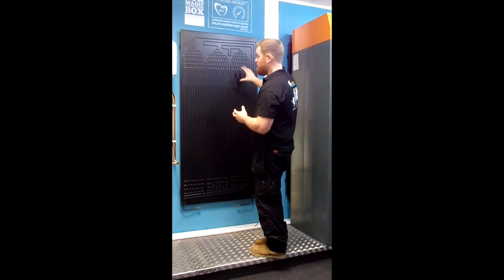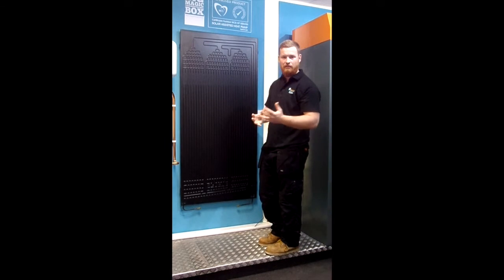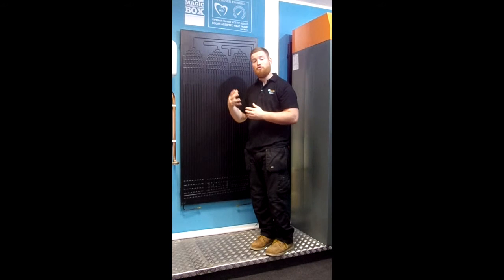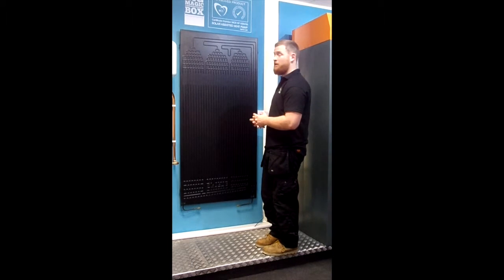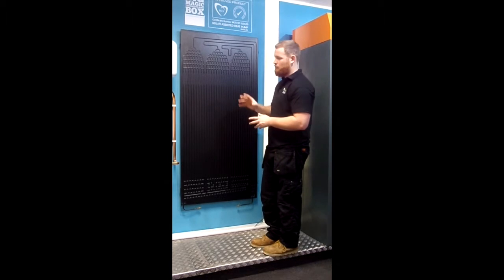Around this area here, we will get evaporation from the liquid refrigerant to the gas refrigerant, or gaseous state. And it's in that state change from a liquid to a gas that we absorb a lot of energy. We also gain energy from a refrigerant that comes in here at a boiling point of minus 28 degrees and returning above zero. It goes back to the heat pump.